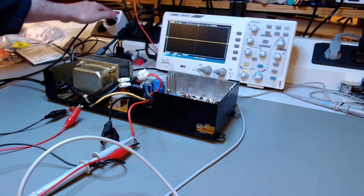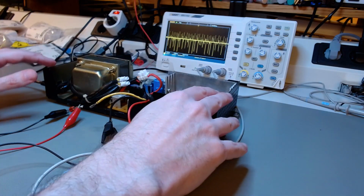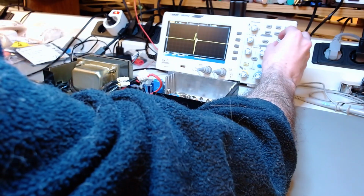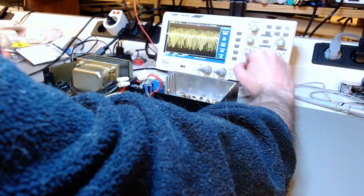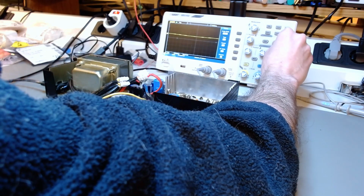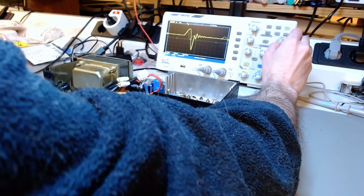I doubled the load, I added more resistors, so now we have an equivalence of a little over 600 ohm or so, which draws more current. But for the 12 volt line, as you see there, there is still a lot of switching noise. And the question is, would that disappear if I have a proper current draw of 1 amp? Only with my programmable load I could measure that, but it's up in the loft above the garage. I don't want to take that out.